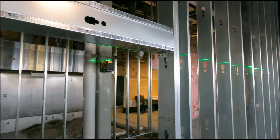Beautiful. So when you're putting the bottom one on, nice and sturdy, what I do is go to the joint first and level the front, square it back, square my studs and square the track. Then I'll go in the middle, square one out, level it, square one out, level it. It's literally just clamp and square and screw off every stud as you go. At the very end I clamp it in the corner again, and I add that final screw to the clip, to the joint.